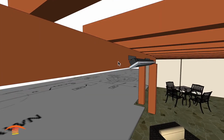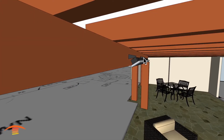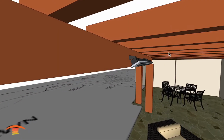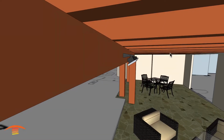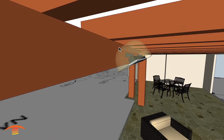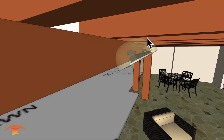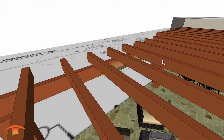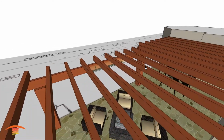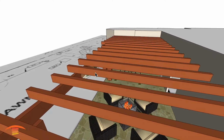When you have a wall mount unit at 60 degrees tilt, you do need to make sure you have that 6 inches of clearance above any ceiling. Wooden structures, I'm not quite sure if that applies. So the normal clearance looks like this in the top, 6 inches around the whole top side of it. Since there's plenty of air movement, it doesn't really require ventilation, it just requires air movement to keep the unit cool. And obviously you're not using this on a hot summer day, but if you ever were to leave it on, that's the precaution that you kind of want to think about.